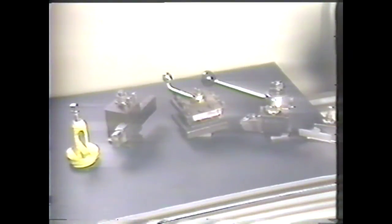In addition to the standard tool post, there are three commonly used specialty tool posts. The open side tool post usually holds carbide cutting tools. The turret block tool post holds up to four tools which may be swiveled into position for quick tool changes.